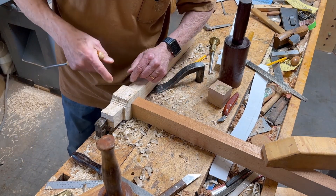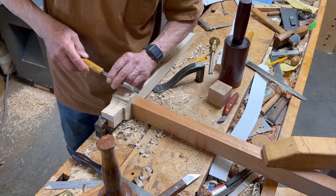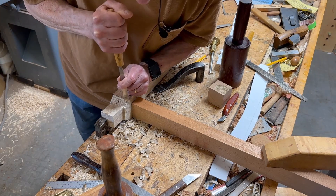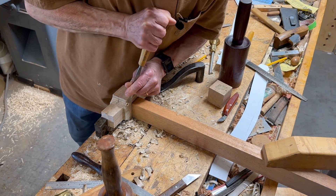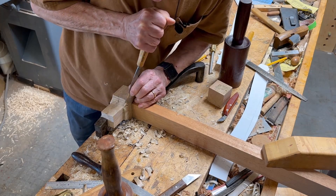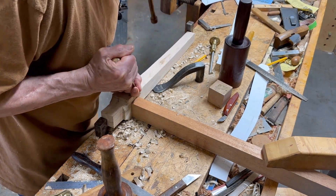This mess was just the band saw. I've got a number five carving tool which seems to fit the shape of that transition quite well. The first thing I do is just knock back a lot of the corner. I already knocked it back there, so let me do it on this corner.